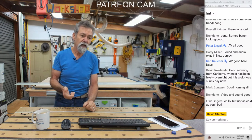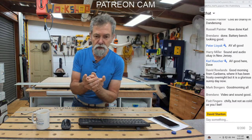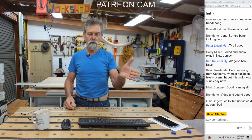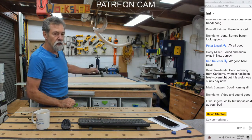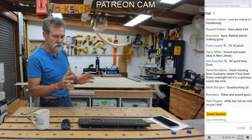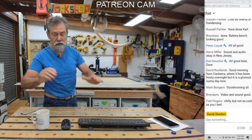The reason being, I only want to cut something around about 4 inches wide, 100 millimeters wide, and I don't want to bite with that on the table saw. So it's a whole lot easier here. Now, the reason I'm using this piece of ply, this is a piece of marine ply. This is not birch. It's not the real expensive stuff, because this one has actually got a big cup in it.